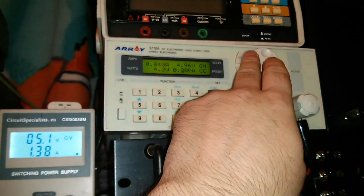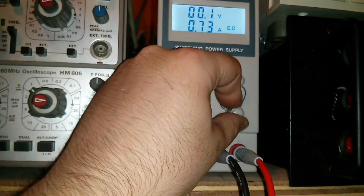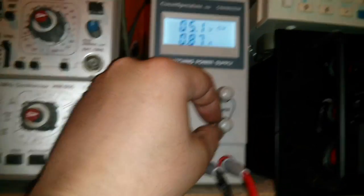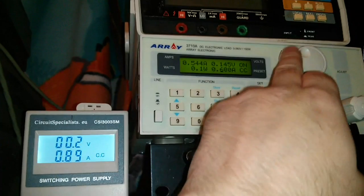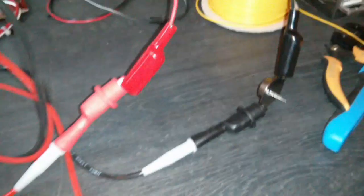So what we'll do, I'm just going to set this to half an amp and tune this in. So that is approximately half an amp there - that's the maximum it'll let me. Just to test that, we'll just hit up to 0.6 amps and it drops off. Put it back to half an amp and it's back to 5 volts. Okay, so we're set up to supply half an amp at 5 volts, and now we're going to connect this regulator up and test it out.